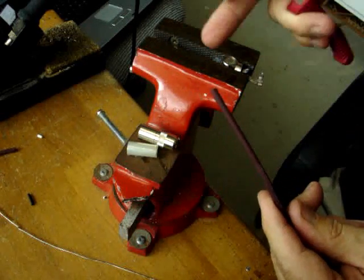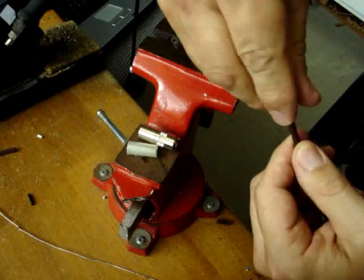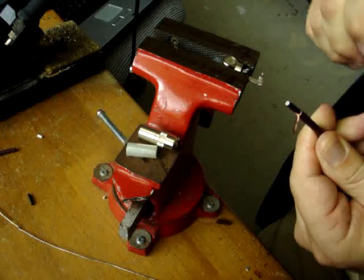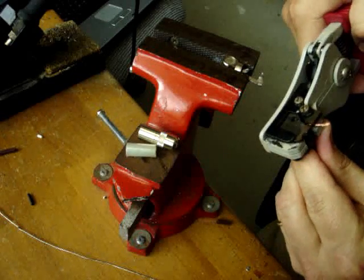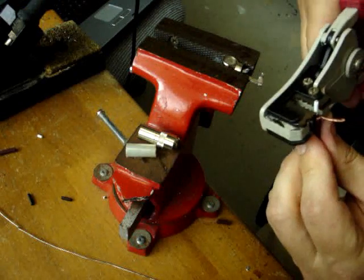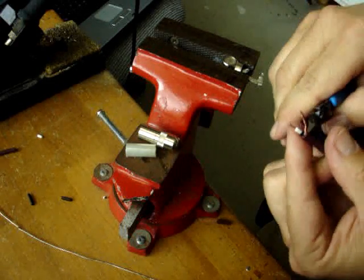You want to follow the writing — this would be the destination side of the cable. Take off the outer jacket with one movement. Pull the shield to the side and twist it together. Then just nick the carbon skin with a smaller setting and you'll see it slides right off. Now we just need to reveal the center conductor like that, and it's ready to trim up and solder.